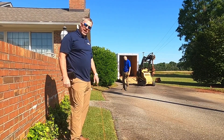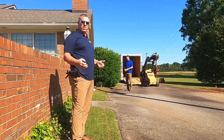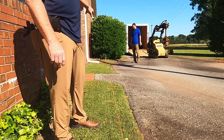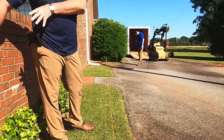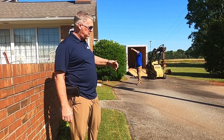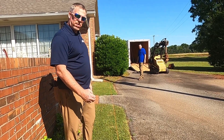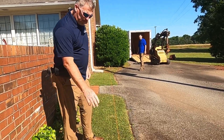So now we're going to talk a little bit about the square. One of the first things you've got to do is identify at least one wall — whether it's a front, back, side, whatever it is. The homeowner in this situation most wanted this side wall lined up because it's going to be against her garden area next to her house. This is going to be a little carport-type shop where she can park under and walk right in. So the first thing we did was get this wall lined out how she wanted it and the back corner. From there, we squared out the rest of the building.